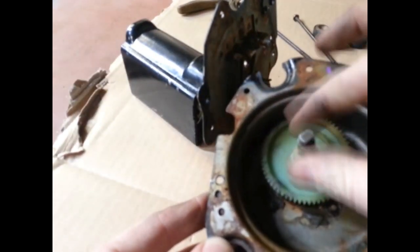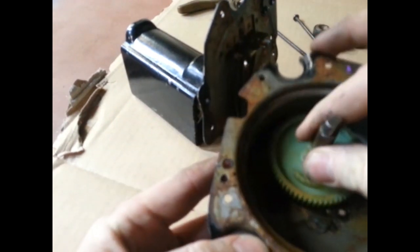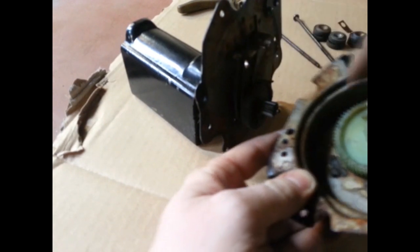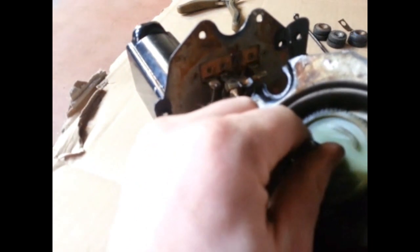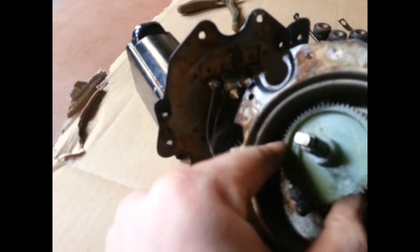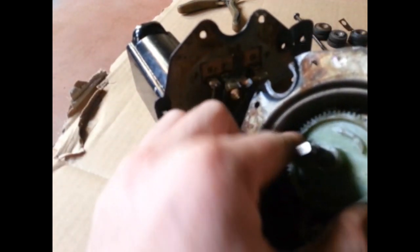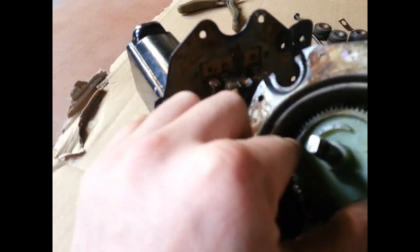This gear is really sticky — need to get it all cleaned up. I'm guessing this contact plate is grounded and provides ground while it's spinning. As it rotates, it's got ground, got ground, got ground — then no ground, and it stops for park. The next time you provide ground it starts and goes around. When you turn the switch off, it parks. Pretty simple.